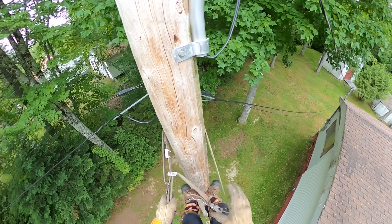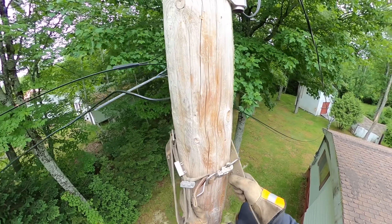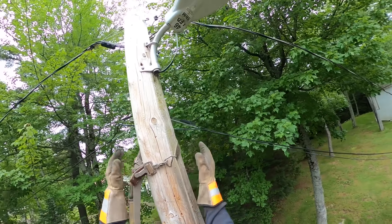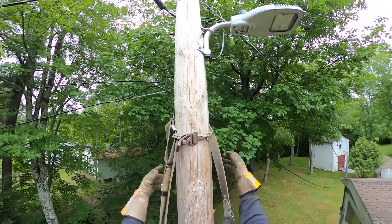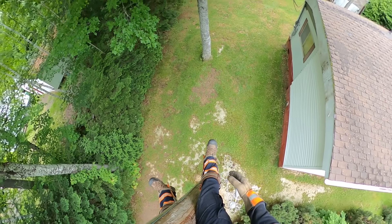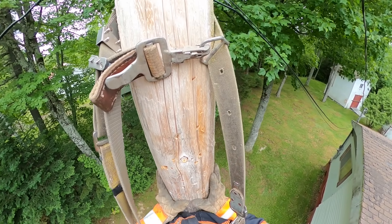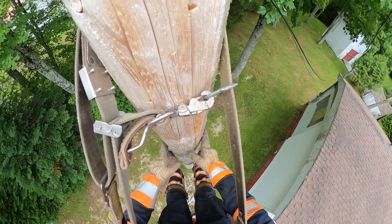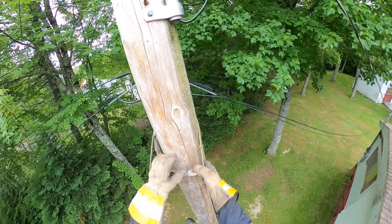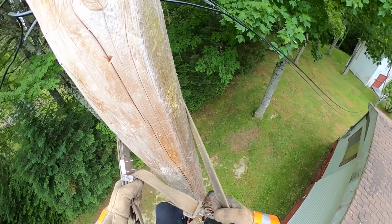Lift our retractable so it's back here — it would still catch me if I slip, but you do want to get it in as close as possible to the pole. That way if you do fall and kick out, your cross strap is already in the catch position. I didn't slip down at all. If this ever happens — two hands on the pole directly in front of you, give a push, and put your spikes back into the pole. Usually if you slip it's a little less graceful than that.